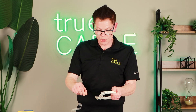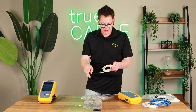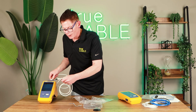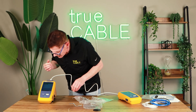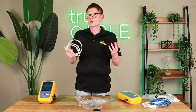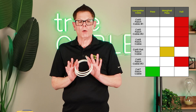Maybe you've had trouble with a patch cord in the past and have no idea why, or unusual communications problems in your network you weren't able to run down. You probably didn't have a $13,000 Fluke DSX-8000 plus $1,200 adapters to run it down. Now this is a so-called Cat 7 patch cord — let's see if it passes on Cat 6. We're testing it and it passed — a full pass. So believe it or not, we've got one pass among the competitors. But it had an easy test: it passed at Cat 6 and it's a so-called Cat 7 patch cord. So we've had a marginal pass — which is technically a fail — and one actual pass on competitor patch cords. That's the state of the patch cord market.